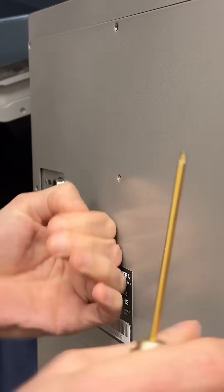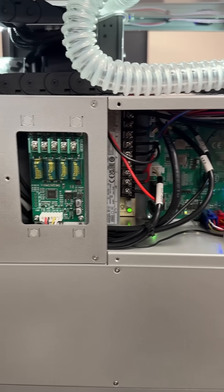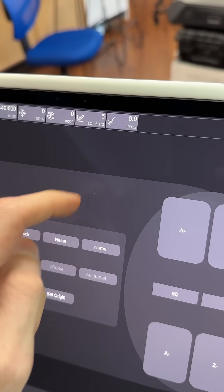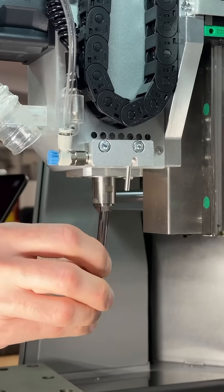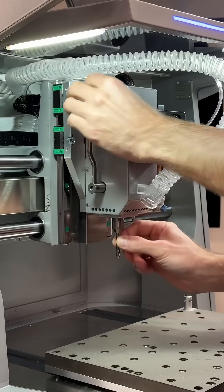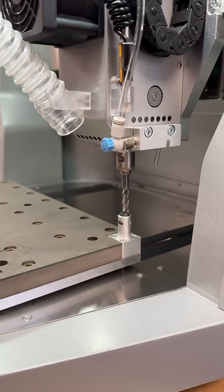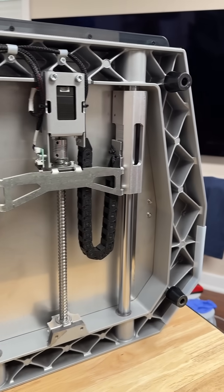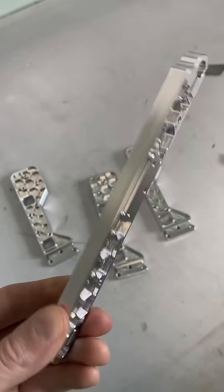We all know those engineers don't usually wire up serviceable controllers like this — labels and all. The 13K closed loop speed controlled spindle has a quick tool changer, accommodates 8 and quarter inch tools with precision collets, accompanied by an effortless automatic tool height setter. It's got a rigid frame that was born to hog out all of my home-built 6061 aluminum projects.